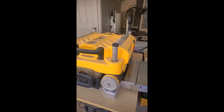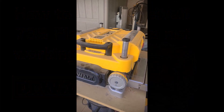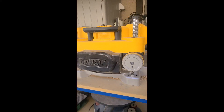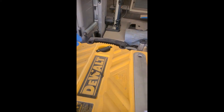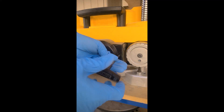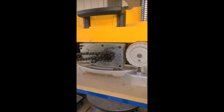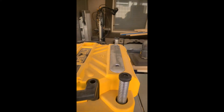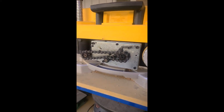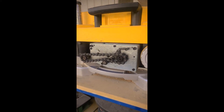The DeWalt 735 — the rollers stopped working on it so I couldn't feed into it anymore. So what we're going to do, I did an inspection and what we need to do is get this cover off right here. I got the other screws off so I just have the one left. There's the cover — the screws can actually be stored up here, which is pretty handy for maintenance. The problem is the rollers don't feed anymore, so that tells me there was a problem with the linkage somewhere in here — one of the pulleys or something.